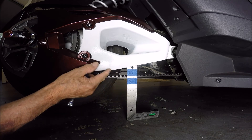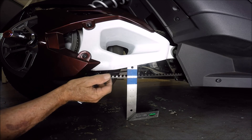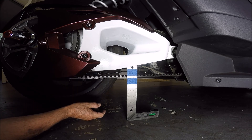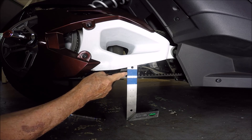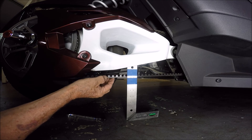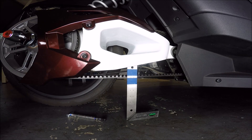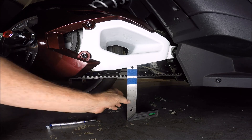I'll actually show you the adjustment and move it a sixteenth or so, just to show how to do it if your belt is either too tight or too loose. If this belt movement had gone up about a sixteenth over — to one-eighth — that might be a signal to readjust the tension. But right there that's a good movement, so I'm satisfied with it.